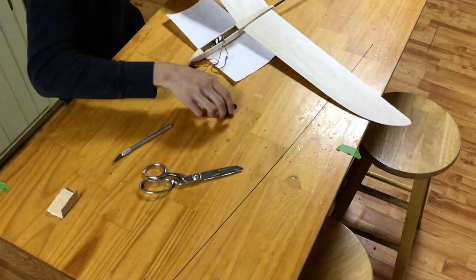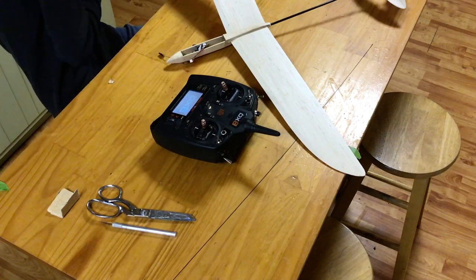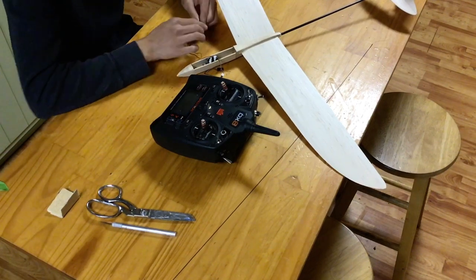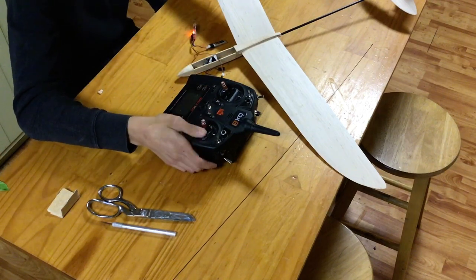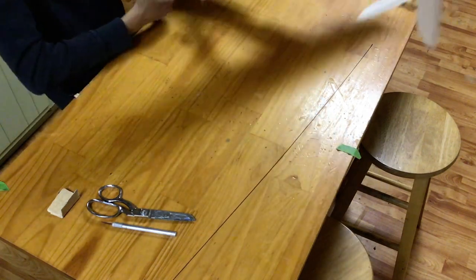the servo arm. It's now time to bind your transmitter to the receiver. I've already done this, but if you haven't and don't know how, you can refer to one of the many transmitter-receiver binding tutorials which exist on YouTube. I'll now plug my servos into their respective plugs on the receiver, and test that I have functionality in the servo in question. Once you've done this, keep your transmitter and receiver powered on during the next couple of steps, because that servo will have to remain centered.